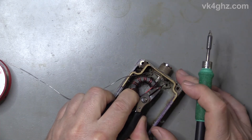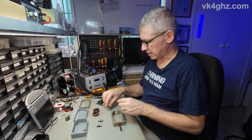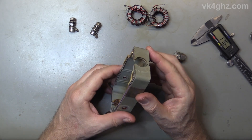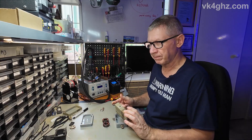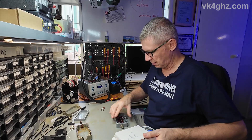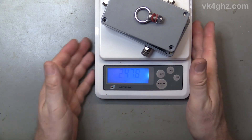First thing to do was desolder the balun, remove the M6 stainless steel hardware, and remove the SO239. That was a bit awkward so I ended up pulling the case away — it had split and it was easier to just pop it out. You can see the SO239 fitted doesn't have a lot of thread on it and you can see how it was recessed into the case. Time to drill the new enclosure. The SO239 and M6 stainless hardware were mounted into the new case, all solder points were touched up with fresh solder, likewise on the balun itself. I wasn't going to replace the eyebolt — even though I had a new stainless steel one in stock, it's just unnecessary weight. The balun itself weighs 233 grams; with the eyebolt it jumps to 248, about an extra six percent of weight I just don't need.